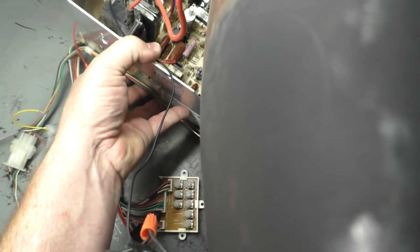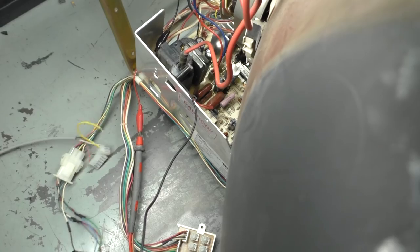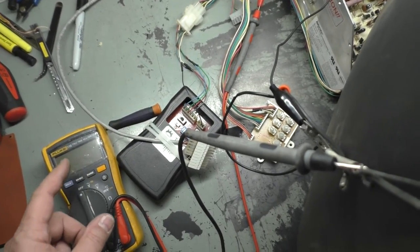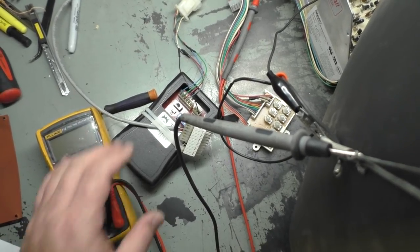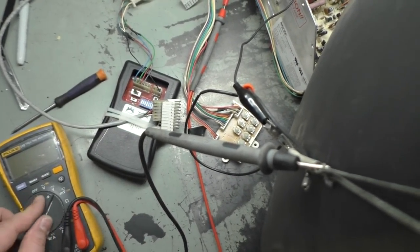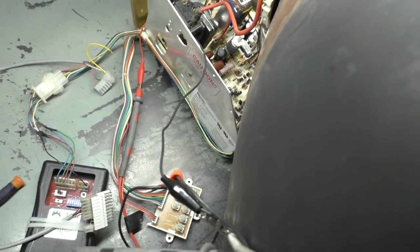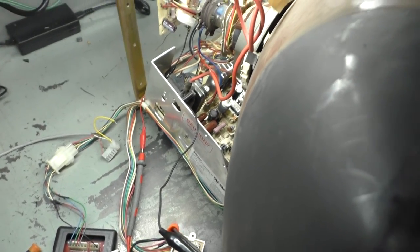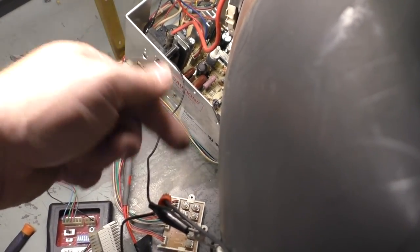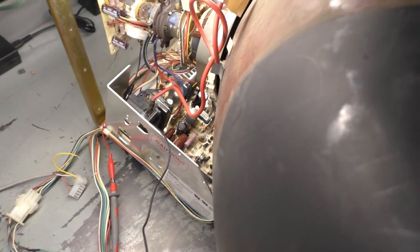After putting that back to center, let's get this set up here properly. Oh, and also in the meantime, I verified that the B plus should be set to 125. So we're all set up here. Let's turn this back on. Meter to volts DC. And let's fire this up one more time and see what happens now with that horizontal frequency pot set to center position instead of being maxed out all the way to the left. So here we go. 1, 2, 3...